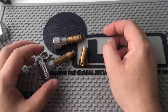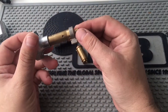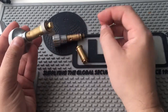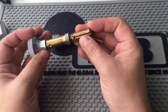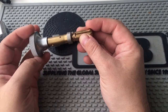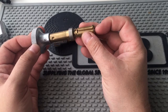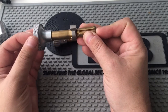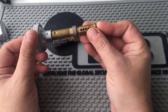The last part is actually when you look at the Euro cylinders. If we look here, we can see that the cam is not permanently engaged with the thumb turn, because when the cylinder is in a locked state where the pins are preventing it from rotating because the right key is not inserted, as we can see, there's a clutch mechanism that makes these operate independently. But what actually happens is when you insert the right key and it finds the magic spot, we can hear it make a click, and now these two are linked together, and that means that you will rotate both parts.